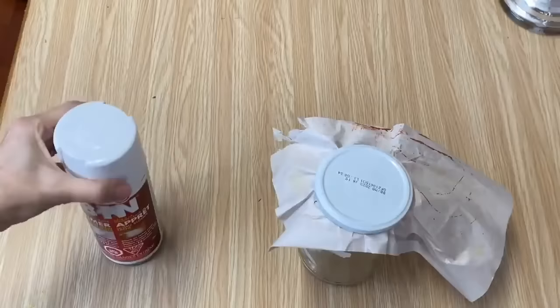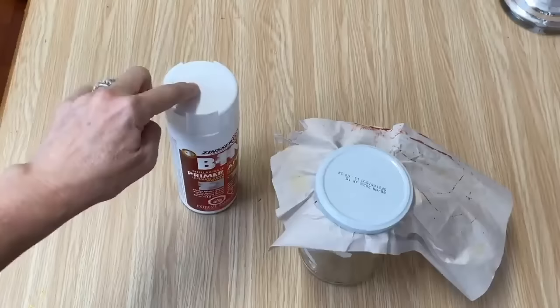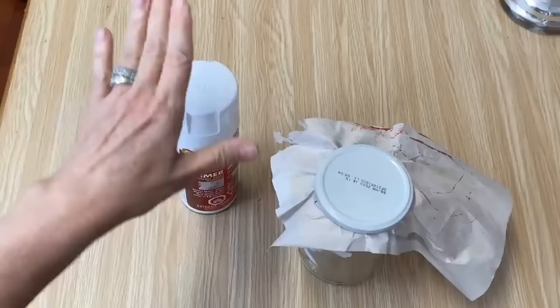When I'm painting my lids, I always like to use a primer. It's really difficult if you're painting with acrylic or latex paint and you don't prime it first — the paint will peel off. Putting the primer on makes it stick a lot better. So for all of these projects, I'm going to put a coat of primer on and then we can paint with latex or acrylic on top of that and it'll stick really well.